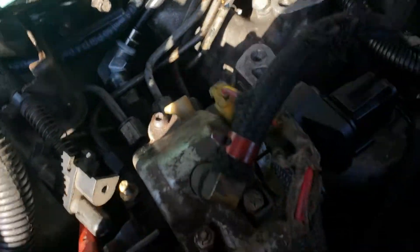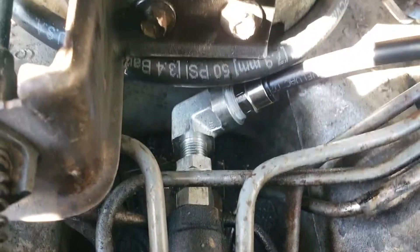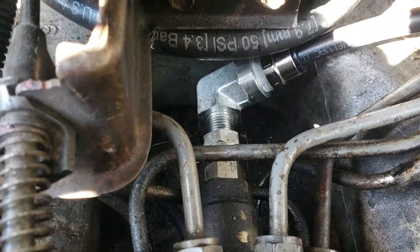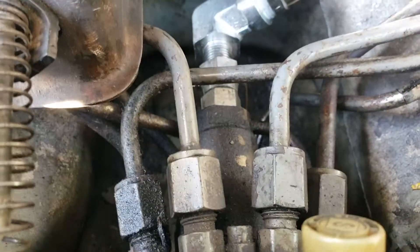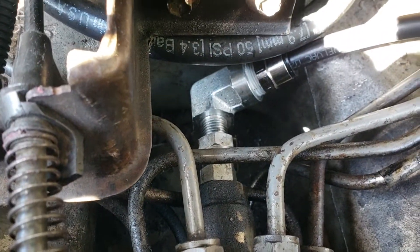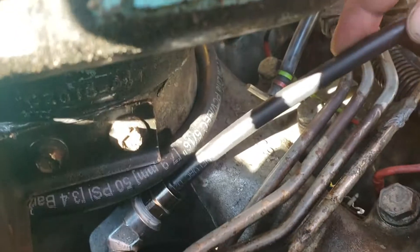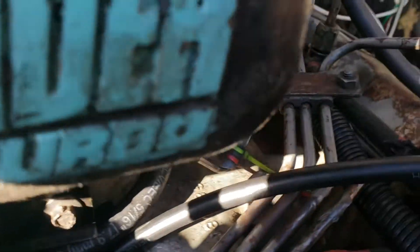Here we are at the engine. That's where it feeds into the injection pump. There's a piece — I don't think it's brass, that's actually part of the injection pump — and then where it's shiny, the new nut-looking thing, that's my new o-ring boss and it's on some sort of a swivel compression fitting. I didn't really like it but that's what he had, so we ran with it. That goes to a 90 and then to a three-eighths with the Legris fittings that are super easy — literally just push down and they come out. Everything's run with this three-eighths.